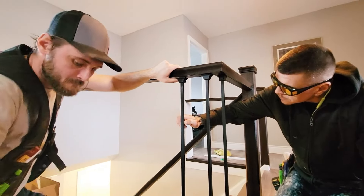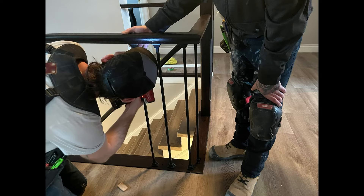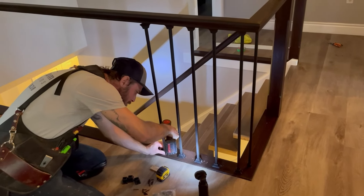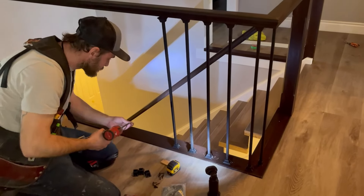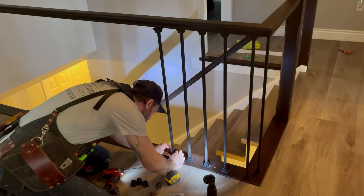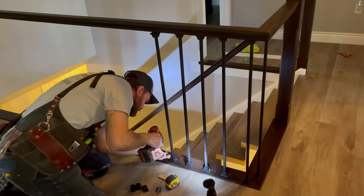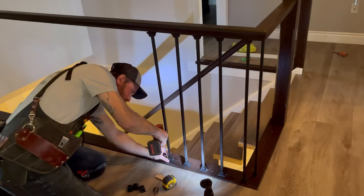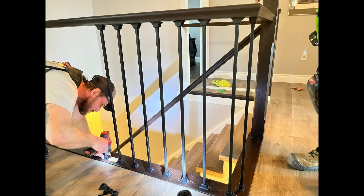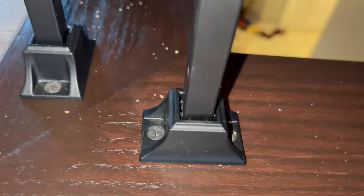You are adjusting that wooden spacer piece to be smaller so that when it's in place it is accurate. Take your time to make sure you make that properly, and then once you do, as you can see here, everything just gets a lot easier along the way. You're just going to be repeating the process — putting that wood into place, drilling, screwing, and continuing along. Obviously you want to be checking your vertical and leveling along the way, but assuming you're using that piece properly, it's going to be lining itself up as you go. For this top railing where the height is the same all the way along, we are using those sturdy flat shoes all the way along. Those swivel ones are going to be used on the stairs themselves, but here they are those flat ones, same at the top and at the bottom as we go.